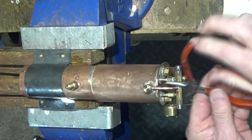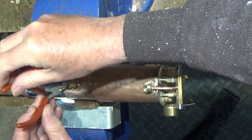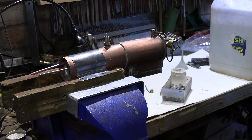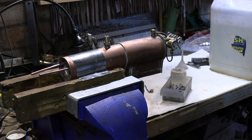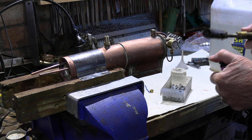I've got a pair of pliers ready so we can finally tweak this safety valve for the right blow-off pressure. What I normally do at this stage of testing is just use my butane torch underneath to provide the heat. The beauty of this is I can take it away very quickly if there are any problems. So let's go ahead and light up.